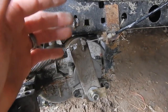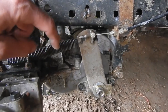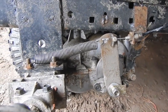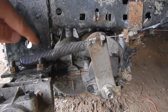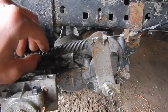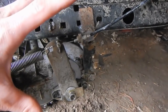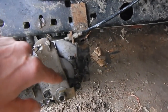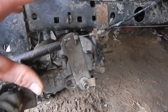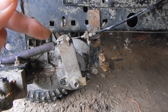Not so much for racing lawn mowers — anything high speed, this is just not going to cut it. But find the sweet spot with your brake lever and make sure your spring is constantly loaded so it's always pulling on the brake lever. Try to keep your spring setup really simple because this whole thing is going to get caked in mud. It will still work if it gets caked in mud — it won't be able to lock the tires up, but it will slow you down, so it is better than nothing.